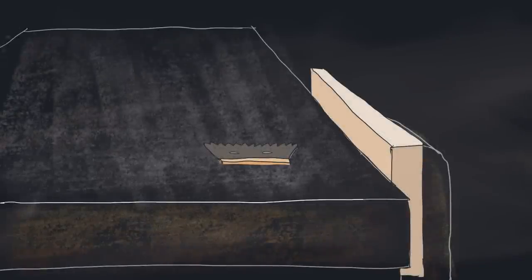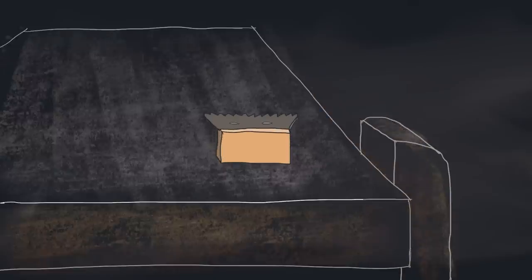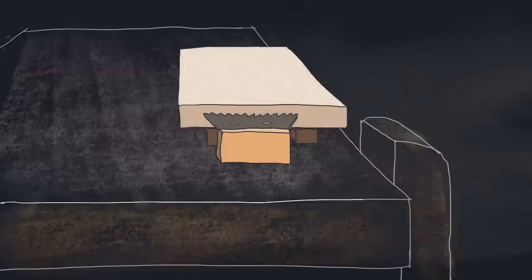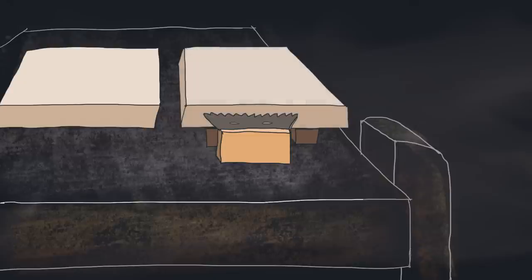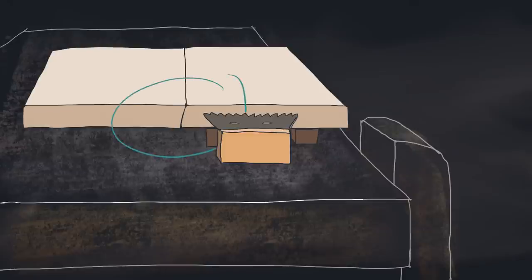To sum it all up: if you're struggling with edge jointing in a conventional way, normally in the face vice, a dead simple way is to set the board on something flat and treat your bench as an entire shooting board instead. If things are looking out of square, you could always adjust the lateral adjuster on your plane. Though even simpler is to remember that turning one of the boards upside down will always ensure that they make up a true 180 degrees together.